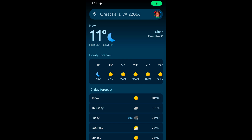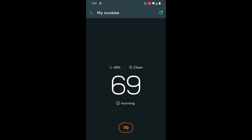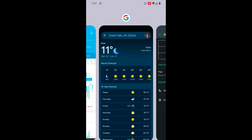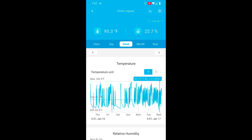It's 11 degrees here — feels like 3 — so I thought I'd finally make a new video. We just got snow recently. The hyperheat is calling for heat, set to 70°F. I warm it up from 68 in the mornings. It's all on stage 2 heating, as you can see at the bottom of the screen. The supply air is now blowing at 95.3°F at the top left. It's been really cold the past 24 hours; the max shown on the line graph is 101.8°F.